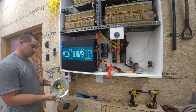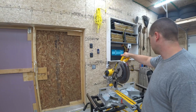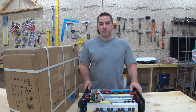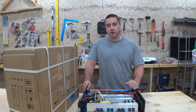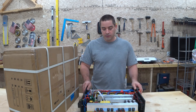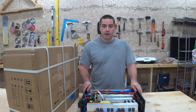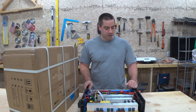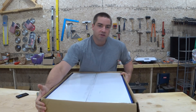The circuit breaker popped. I reset the circuit breaker that I had added external to the inverter, and the inverter still did not turn on. So I took it out and replaced six fuses in the inverter and tried it again - still didn't work. Then I went into diagnostics, tried checking with my multimeter, went back and forth with Reliable Electric through a few emails trying to figure out what was wrong, and they decided to send me a new unit.